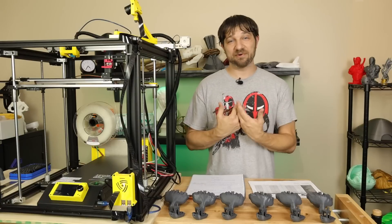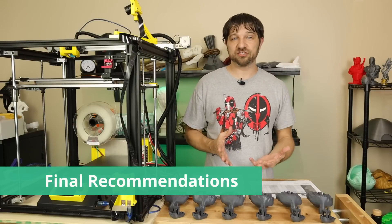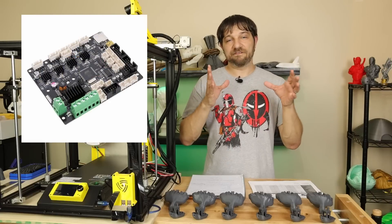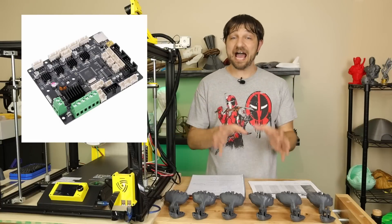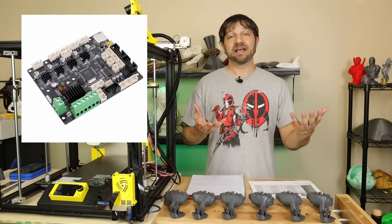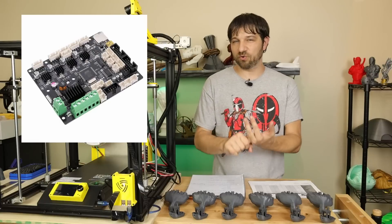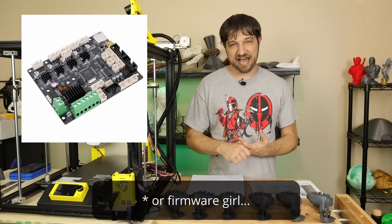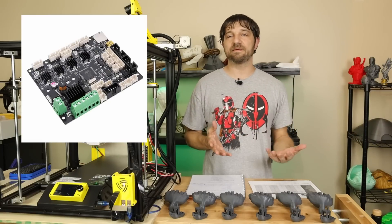So let's finish with my final recommendations. The Creality Silent board is for those who don't want to mess with firmware or modify their case, and are happy with their Ender 5 Plus performance but just want to quiet it down. If you want better stepper drivers without the hassle of firmware and you're not a firmware person, the Creality Silent board is an inexpensive choice and I still recommend it for those people.